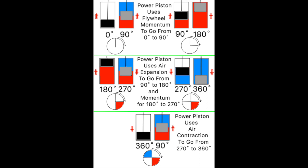The power piston is the black square on the left side in each of the five frames. The drawing has been simplified for purposes of illustration. In an actual gamma engine, the top of the displacer cylinder would be connected through an opening or hose to the bottom of the power cylinder. I omitted this important detail in the drawing in order to keep things tidy and easy to follow. Keep this connection in mind as you follow the steps of the process while looking closely at the drawing.